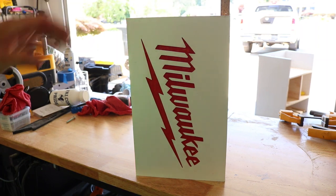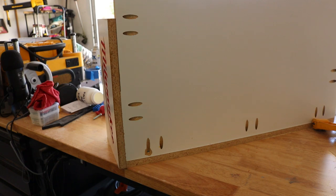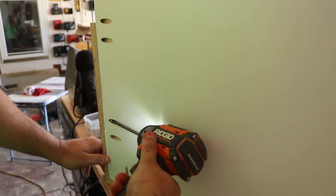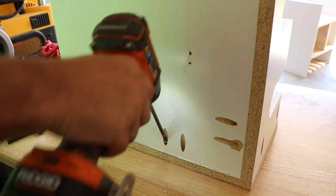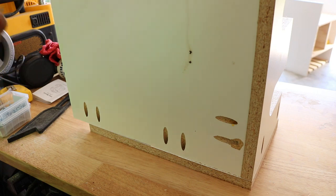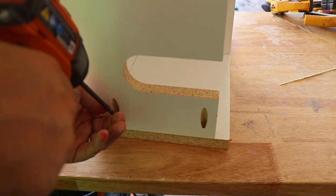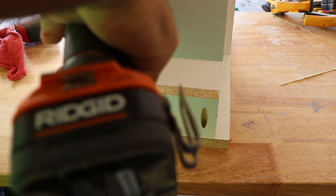Both sides are carved, stained, and finished. Now we add pocket holes — remember the pocket holes in the back we added earlier, those are what these are for. Since this goes up against the wall, you'll never see them, and they really hold it down nicely. I also wish I had brought that top pocket hole down toward the middle a bit more. And make sure you've added those pocket holes on the top and bottom of the hanging shelf as well.